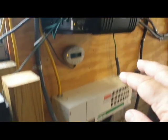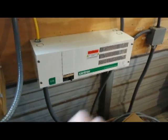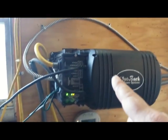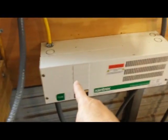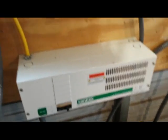This is a single-phase inverter, but luckily I had a T240 transformer — you can see it in some of my other videos. It was used as a standby system with a different inverter. It's just a huge transformer with no solid-state electronics inside. It allows me to create a second phase, so I have 120 volts single-phase coming out of the inverter, going into the T240, and out as two-phase 240 volts — 120 volts per phase.